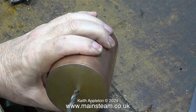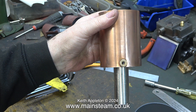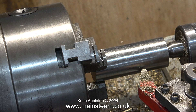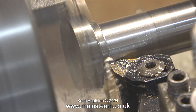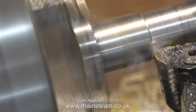I like the parts I make for models to be in scale with each other. Here I'm drilling a hole in the bottom of the main water tank to take an M6 bolt, and I'm showing how hideous the column looks in its unmachined state. I tested the depth of the countersink underneath by fitting the bolt — everything's good. I put the top tank on the wrong way round, but this wasn't intentional. This next sequence in the Boxford lathe was very difficult — I think I need to check the head bearings or at least the lubrication points.